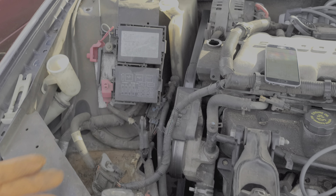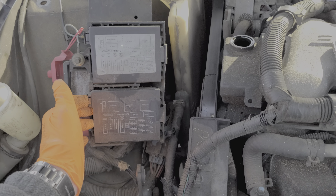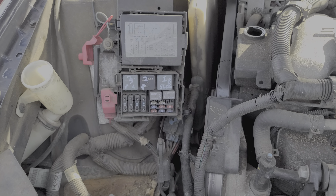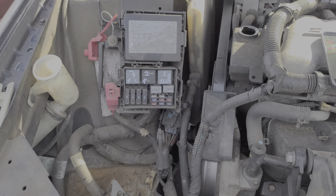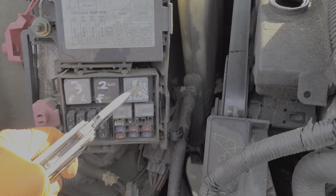We've got two fans and my favorite way to troubleshoot these is I'll come in here and I'll see if I can turn the fan blades by hand. Be careful when doing that as the fan can come on at any moment and if your fingers are in here you could get hurt. If you're not able to turn the blades by hand then that's giving you a pretty good indication that the motor is seized and should be replaced.